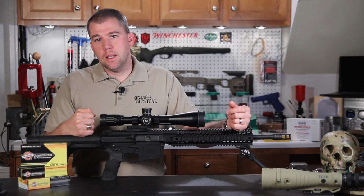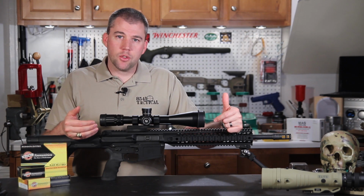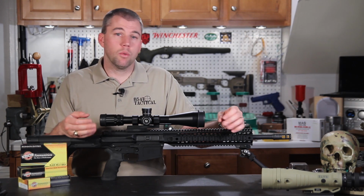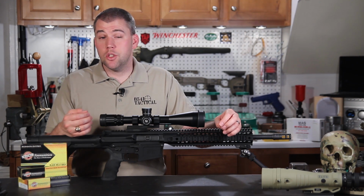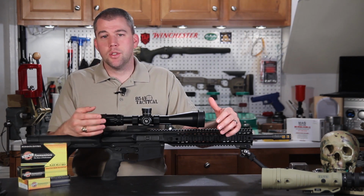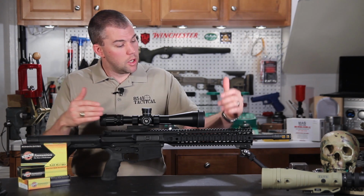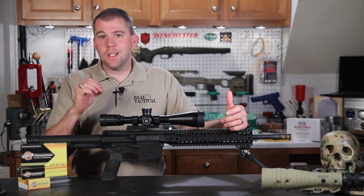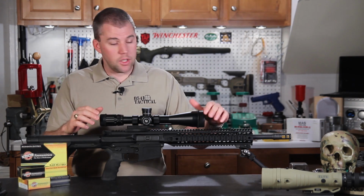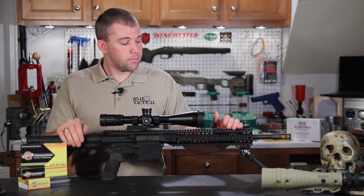But in a serious work rifle, that little bit of extra gas is going to ensure that if it was a bad day at the factory, if they threw a low powder charge, if your ammunition was cold, if your bolt carrier was gummed up, etc., you're still going to have enough energy to chamber that next cartridge. So overgassed just a little bit is the better condition for a working rifle. If it's a game rifle, you want just enough to get it to function reliably.